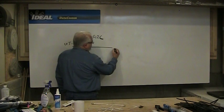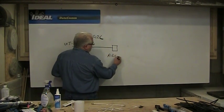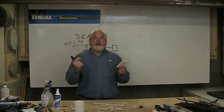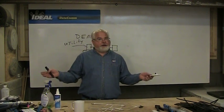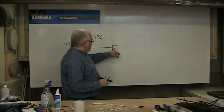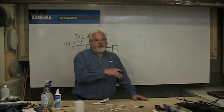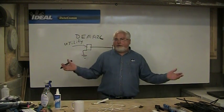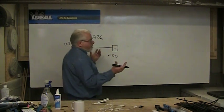We pull wire from there on into the building. The standard recommends that we install what are called auxiliary disconnect outlets inside the building. The auxiliary disconnect outlet is basically just a basic connection — it's a testing point inside the building for service. Say I've got a telephone problem in the house and I don't know if the problem's in the house or outside. I can go downstairs and stick my tester or plug my phone into that point, and if I get a dial tone I know the problem's in the house. It's also meant for apartment complexes where a tenant can physically disconnect themselves from a service inside the apartment without having to go all the way out to a demarc, which can be pretty far away.